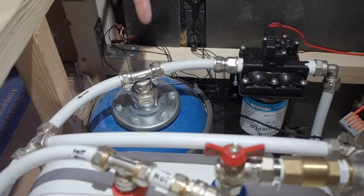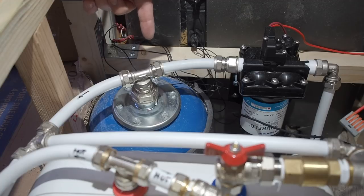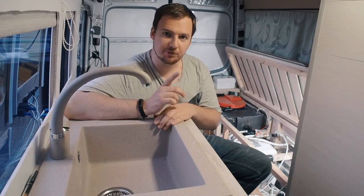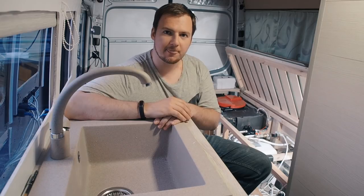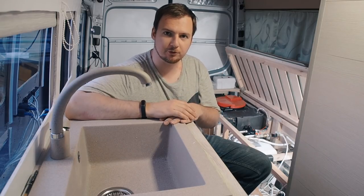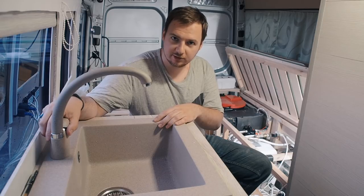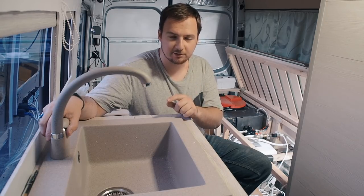A few words about the water accumulator, or water battery. It's sometimes called the expansion tank or water pressure tank. So why do you need that? This water battery has its own water tank, and it's a pressurized water tank. That means that the pump already makes a pressurized amount of water that is held in this accumulator. And with that ability, we can turn on the water a little, and it will go not from the pump, but from this tank.